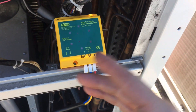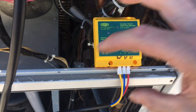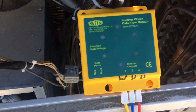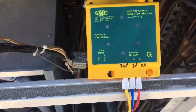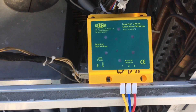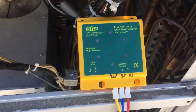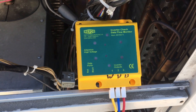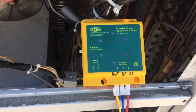I just heard a solenoid open up over there. This one has already gone through all the pulses — all the solenoids have clicked. The expansion valves have rotated all the way out and all the way back in to find their center. I'm listening to the ticking over in the master; I still hear occasionally some self-centering of the stepper solenoids.